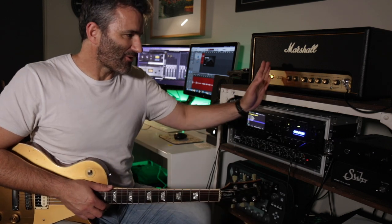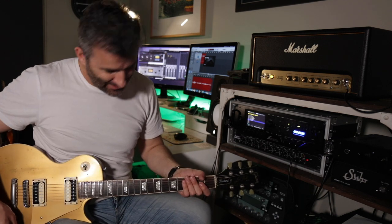Let's move the amp into the first of the clipping modes. That's the 20-volt Zeners — let's call it the first base in terms of Jose clipping mods. The amp is dialed in the same as it was. I've just brought the master volume up to compensate for the drop in volume you get from the compression from the Zener diode, and I've brought the bass back a little bit because with the clippers on, you get a bit more bottom end out of the amp.